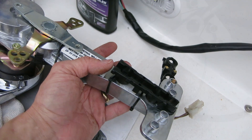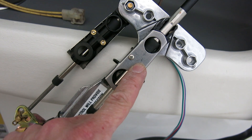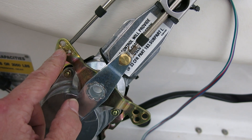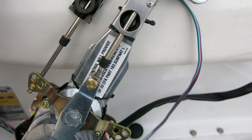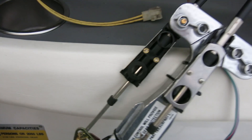I've reconnected the cables and also attached the clips with the screws that weren't in the old model — I think that's really important because if this clip falls out and the cable falls out you've got no control of your boat. Obviously reinstall your cotter pins. This one here is your throttle cable so make sure that's hooked up to throttle, and the arms out here are your shifter cables — I've reinstalled them in the same spots they were before. Now I'm going to connect my electrical connections: this is the cutoff switch and this is the trim connector. I'll plug those back in, tuck those wires up, and then reinsert this thing and finish installing it.